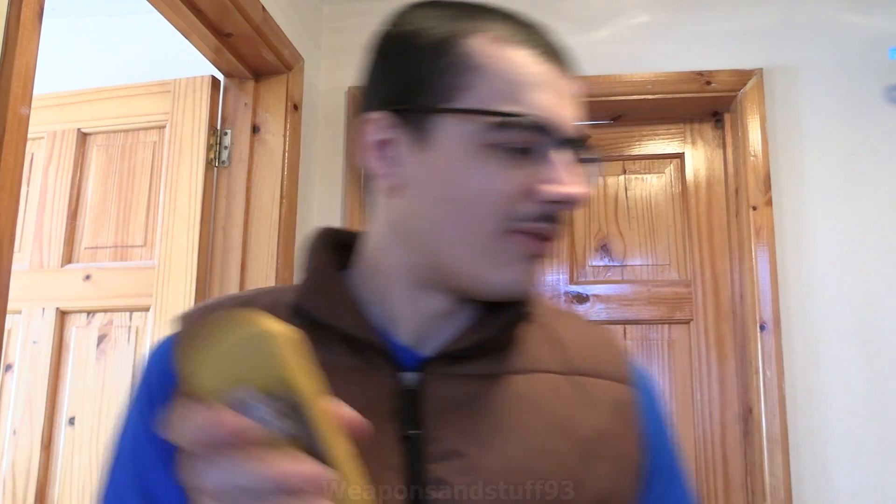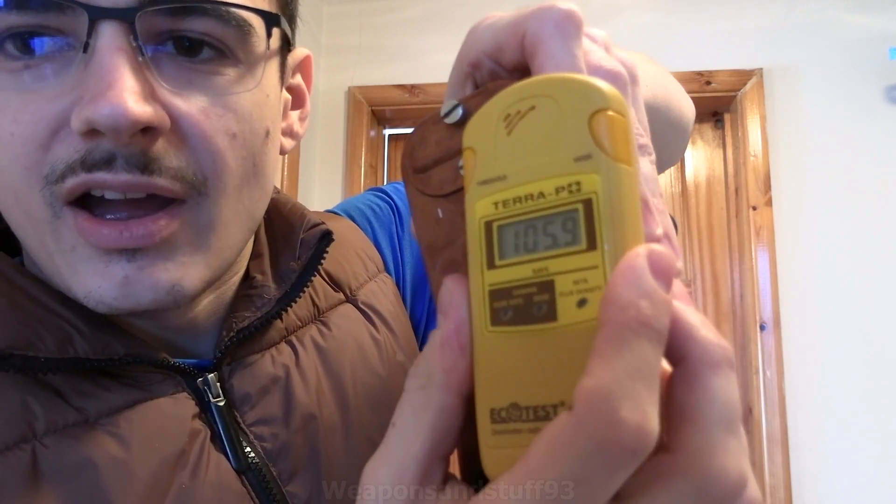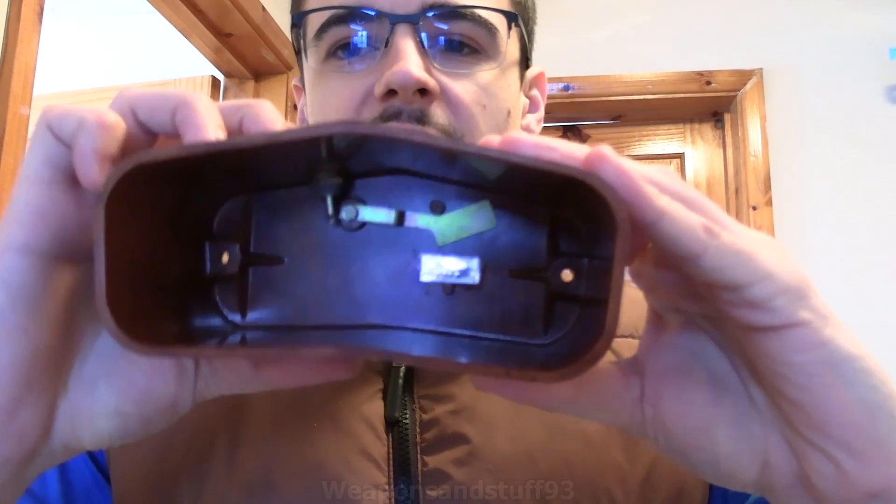If I put the audio on, you'll be able to hear this. So let's put this near the Geiger counter. I need to go back onto the correct mode — dose rate, there we go. Oh dear. Now some of you might be able to guess why that is. There is actually a check source inside here, but it's not the check source doing that. Let's open it up and show you. The check source is quite neat — when it's in its case, you have a button here, and that's a spring-loaded bit that exposes strontium-90. You'd be forgiven for thinking nearly all the beeping is coming from this check source here.